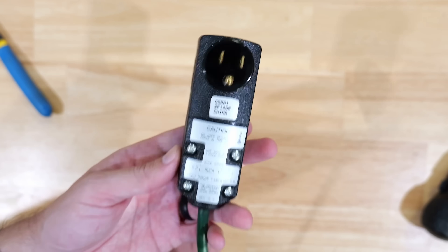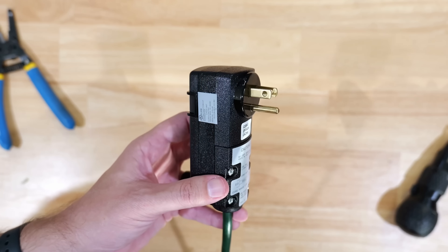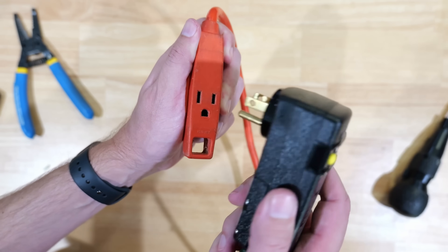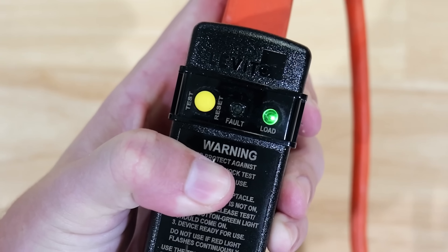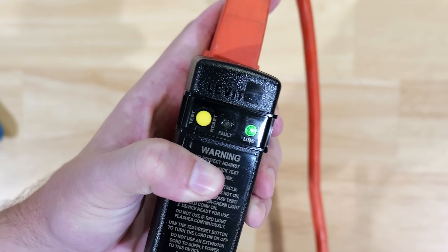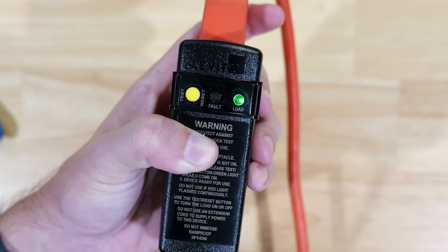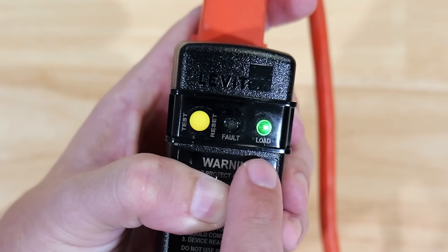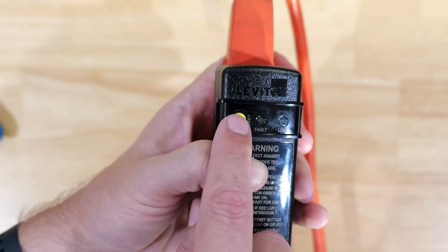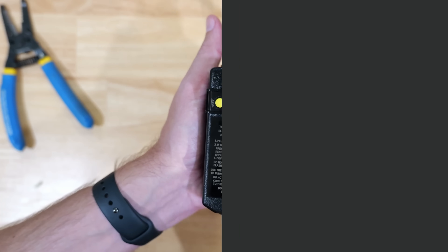There you go — we now have a GFCI plug fully installed and wired up on the cord. This can go on pretty much any cord, whether it's for appliances, outdoor tools, or anything in a wet environment. To demonstrate how it works — plugging the new plug in, you can see a green light comes on on the load side, letting you know the cord is protected and being monitored for ground faults. Pressing the yellow test button successfully trips the GFCI — it briefly blinks showing a fault. After resetting, the green load light comes back on and the cord is protected again.